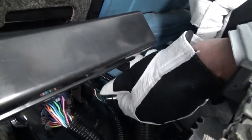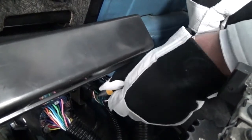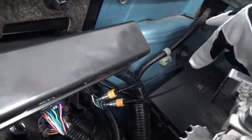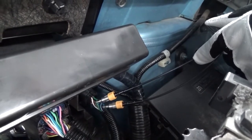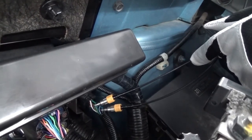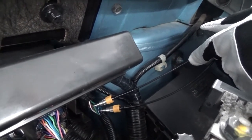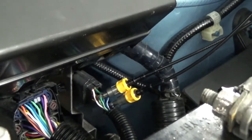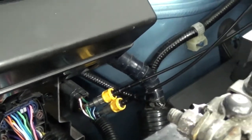CAN is made of two differential voltage lines. Attach a probe to CAN high and CAN low. Hioki's unique technology allows for voltage sensing from outside the cable insulation, so damaging metallic contact is no longer necessary. Because of this, there is no worry of changing the electrical characteristics or interrupting communication.